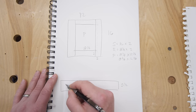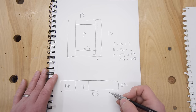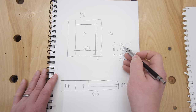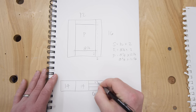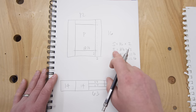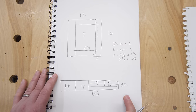The panel is wider than my board, so I'll use two pieces, each 14 inches long. The remaining stock will yield the door components at two inches wide. Using rough lengths of 17 inches for stiles and 10 inches for rails: 14 plus 14 is 28, plus 17, plus 10 equals 55 inches — less than the 63 available. So yes, this door can be cut from this one board.